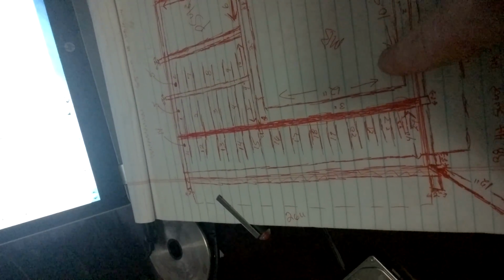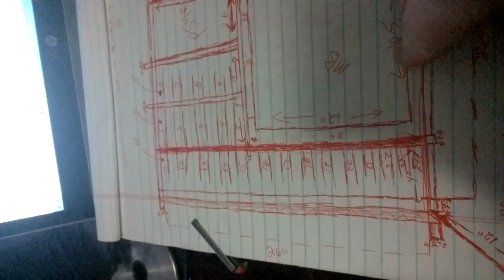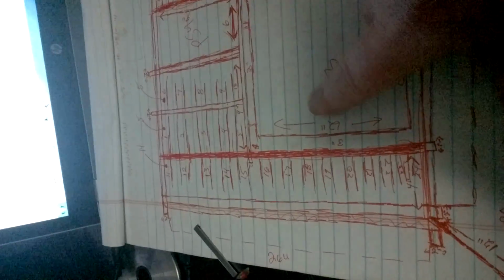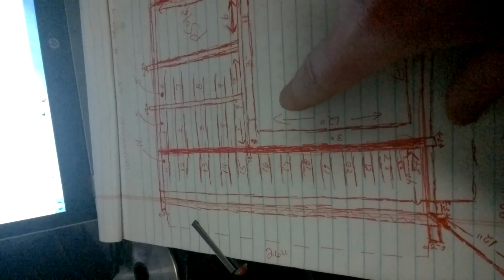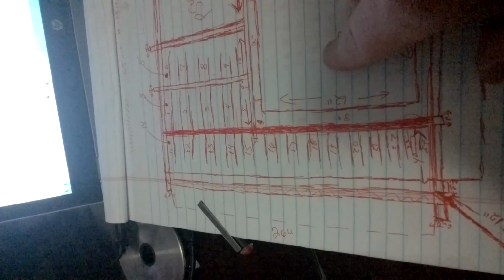So this particular board, the X99-EWS, has 7 PCI Express lanes, and this is one of those wonderful new boards, based off of the X99 chipset, that will actually support X16 across 4 independent lanes, 4 actual X16 lanes. Or in the particular configuration I'm going to run it, at worst you would still have no less than X8 across all of them, which is a big ask.